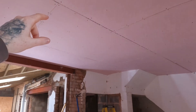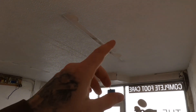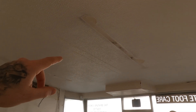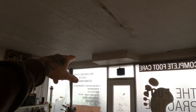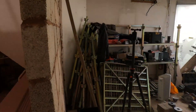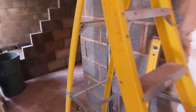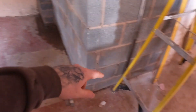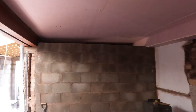Right, that's this ceiling all done — it's been double boarded. We've double boarded out there as well and the other room, which I'll show in a second. All we have left to do is double board this area here — two layers of fire board — and then there'll be a drop-down perimeter with LED lights going all the way around. This is the waiting room and reception. This is treatment room one. In here, we've blocked up this area, and this is the fire board we've done — we box around the steel with fire board too.